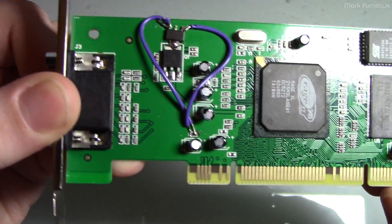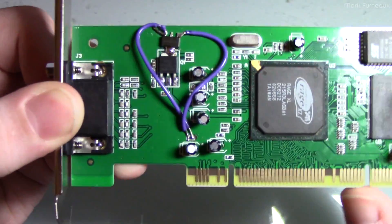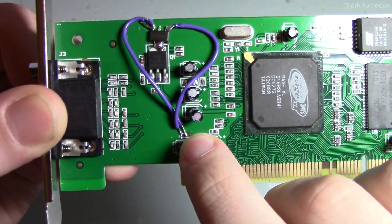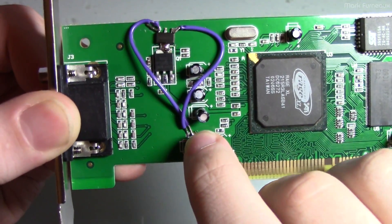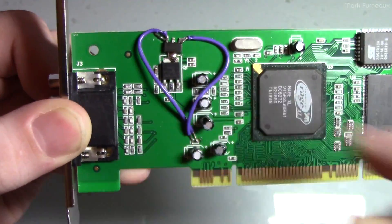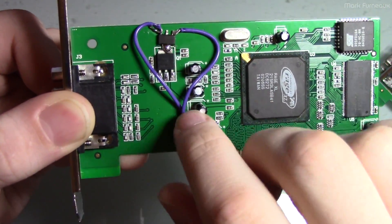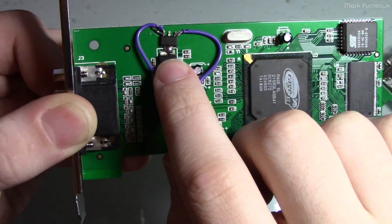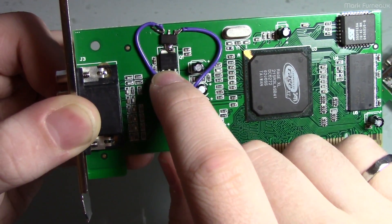What I've done is I've just taken a little 3.3 volt fixed regulator that I got off some monitor PCB — so that's totally salvaged. The 5 volts comes in, there is a filter cap for the 5 volts, and there's an unpopulated pad here, probably for a resistor or a link or something that's not used. So I've just tapped off that into the ground — actually, that would probably be a ceramic cap because there's ground on one side. I just bring up ground and the 5 volts to this regulator, which regulates down to 3.3 volts, and then I just soldered the output to the tab of this series pass transistor.